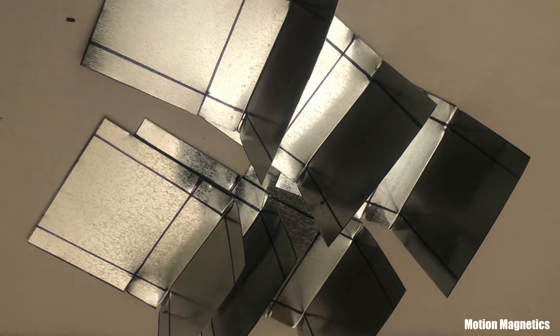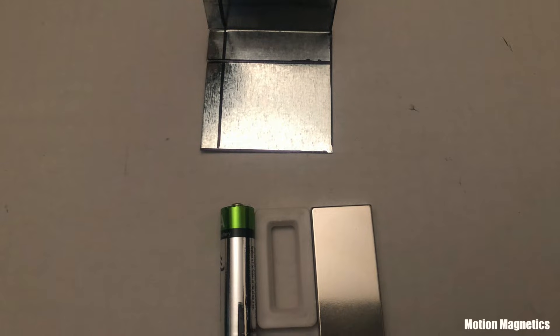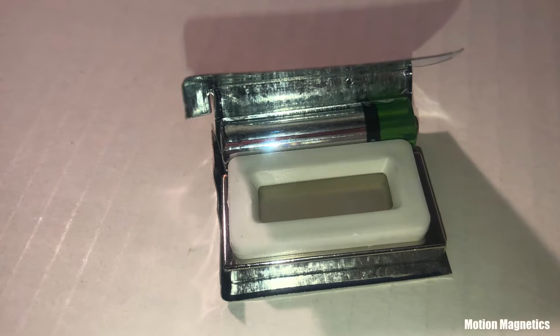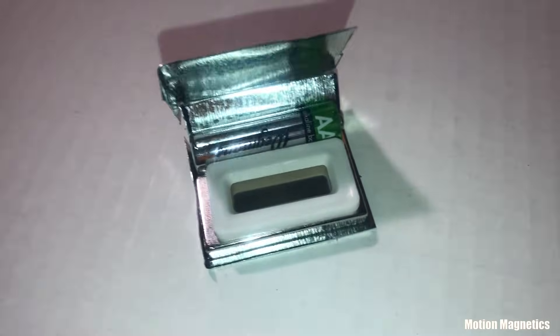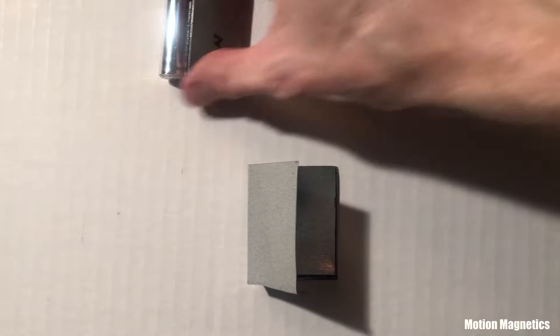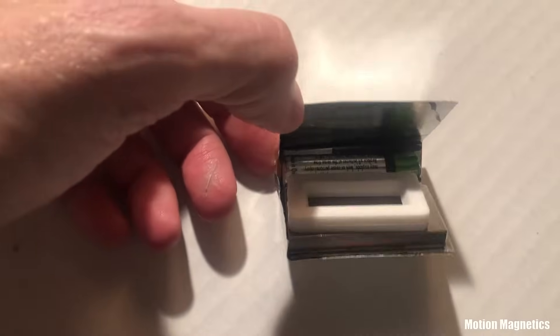I also added metal cylinders in two of the casings for extra shielding and a thick piece of mu metal between the 3D printed spacers and the other shield casing. The other five stators I set up similar to James Roney's original stator design. There's a quarter-inch thick spacer made of folded cardstock paper, two completely drained dead alkaline batteries, and I used one of the spacers that came with the magnets I ordered on top of the magnets in each stator to provide spacing between the metal shielding. The batteries are simply for additional shielding — make sure they are dead if you build your own stator so they don't explode on you. There are two layers of metal shielding. This is how the parts go together with each layer. This is the stator that was the closest to James Roney's original design.